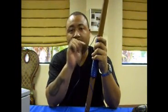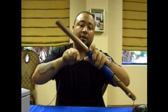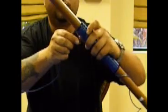Now to do the second wrap on the coil, make sure your coil direction is going in the same direction as the first coil. So you would commence to wrapping the coil back on top of the existing coil the exact same amount of times as the bottom one. As you can see, I'm keeping these close together as I did on the first wrap. And we would just wrap this all the way down to the bottom of the first coil wrapping.